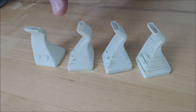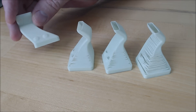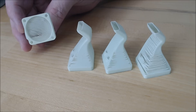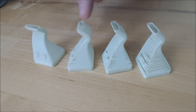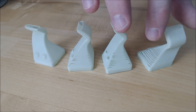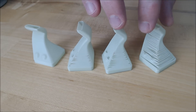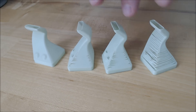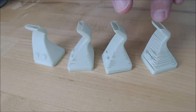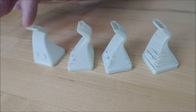As you can see looking at these, obviously this one here is a good solid print — it printed nice and solid, that's just the way this print is set up and it worked good. The first one I printed was one of these here. The interesting piece is this one was in a situation where it was trying to print in midair quite a bit, so it was obviously a very bad print. What you have here are 0.3, 0.2, 0.15, and 0.1 layer heights.